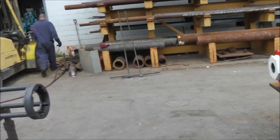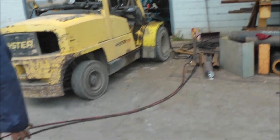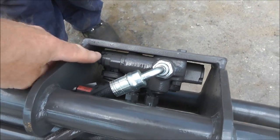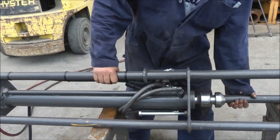Thank you Ryan, why don't we just do a quick demo here. For auxiliary hydraulics we're using a Hyster forklift and we have an adjustable pressure regulator right here on the control valve. This screw allows you to set the pressure. We suggest you keep it as low as possible that still does the job — that'll be easier on everything. Go ahead then, Ryan.